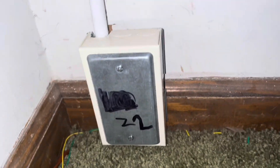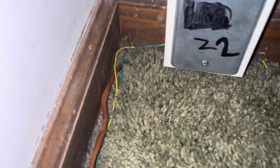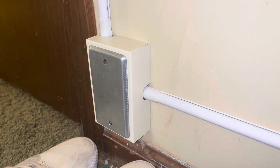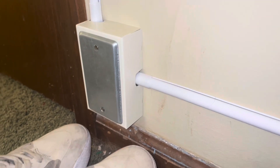Going to the left of the fire alarm panel and all the way down, we go to a junction box for Zone 2. There are splices in here for Zone 2 because the wire was short, and I wanted to have another junction box by the fire panel. Following this wire all the way around, in front of my shoes and up to the left, we have a junction box full of wires that connects the NAC for out here. There's only one horn out here, and the pull station and smoke detector for out here.